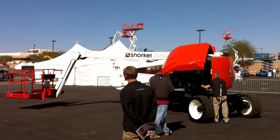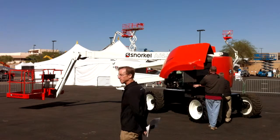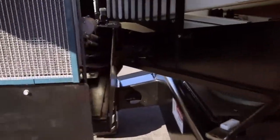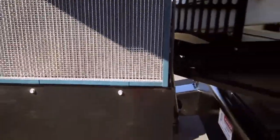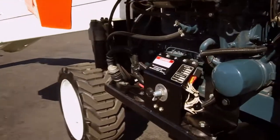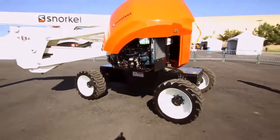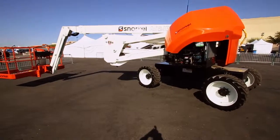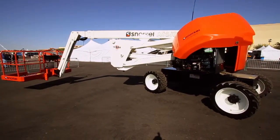The same hydrostatic drive pump operates into all four wheels, which have 38cc wheel motors, offering full-time four-wheel drive. With the amount of power we put out, we're able to maintain a 45% grade ability without a problem, so rough terrain drivability as well as grade ability is excellent.